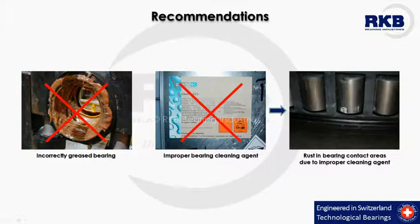We suggest not applying an excessive amount of grease to bearings because that can lead to damage due to overheating. Moreover, it is of paramount importance to recall, as a rule, that bearings at first use should not be washed, but for further washing procedures they must be immediately preserved in a proper manner. In any case, it is forbidden to use any cleaning agent that, after drying, might leave solid or aggressive substances on bearing surfaces.